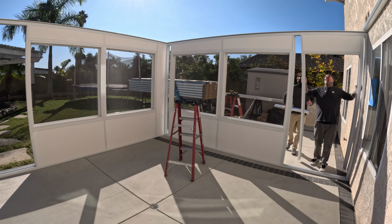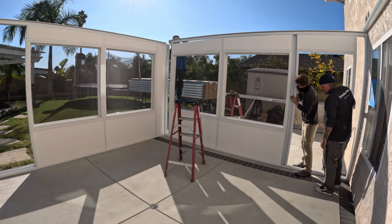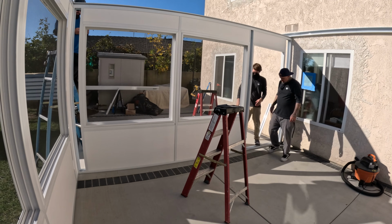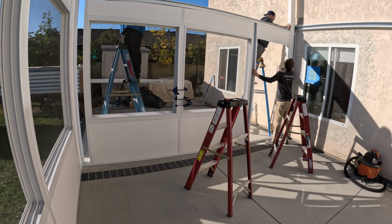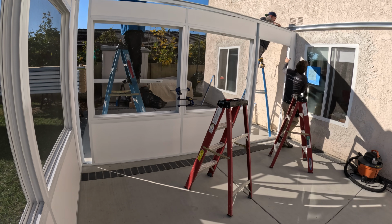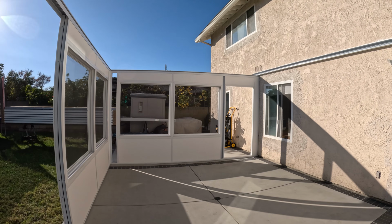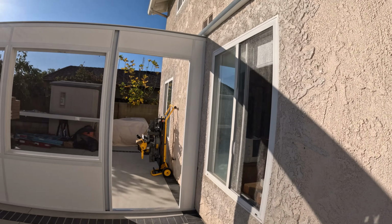And there's the frame going in right there. So we normally put a mullion or electrical channel you see next to that door, next to the doors if there's room, because you can put a porch light outside that and just have a switch. So it's usually good to have a porch light outside a door when you're exiting it, so you can have proper light when it's nighttime.